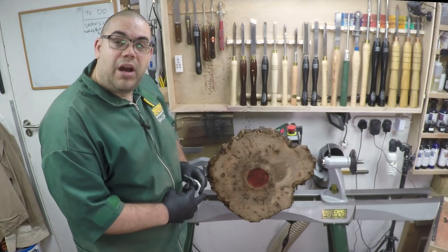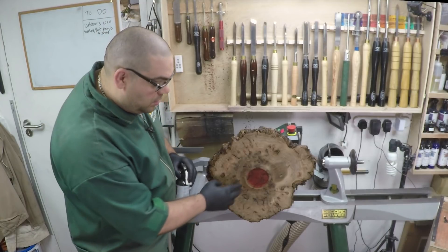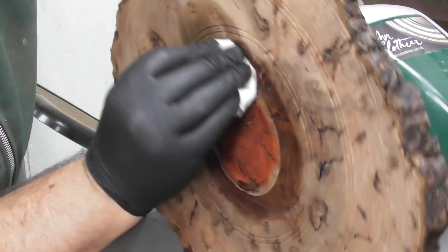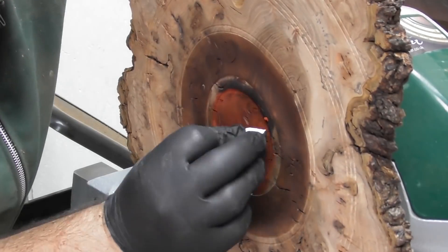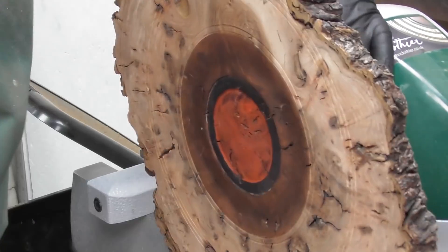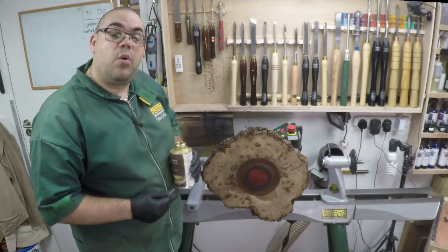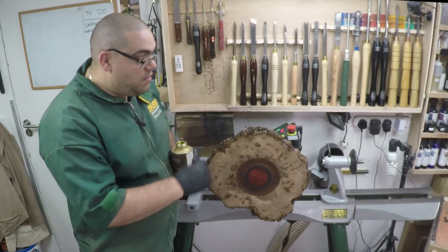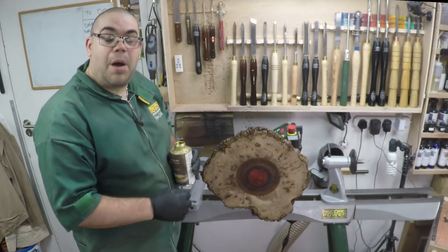That's the red done and now it's time to apply the brown. I haven't concerned myself too much with keeping within the area — when we put the black on that's going to cover up any of the red that overspilt anyway. It'll be the same with the brown as I go this way, but as I come out I do want to be a little bit careful not to get any brown onto that section. That's the colour complete — quite straightforward, a very simple project but very effective. Now I'm going to give it a good coat of Danish oil, applied with a small brush so you can get right into all the little nooks and crannies. I'll leave it to dry for 24 hours then give it another coat, repeating that two or three times, and then we'll come back and do some pyrography.